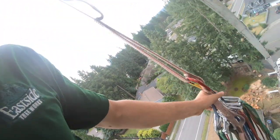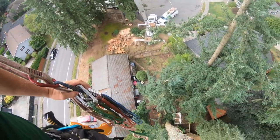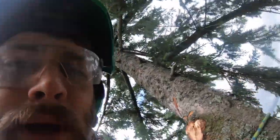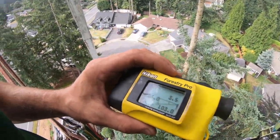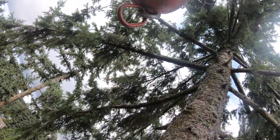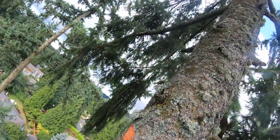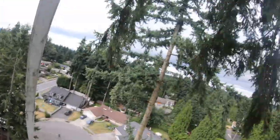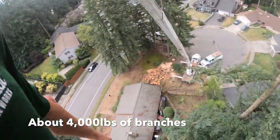I just wanted to show how to use the sling that nice guy Dave and myself came up with - that's the long jake. We've been working on this probably 45 minutes or so. I'm at 103 feet right here - we measured it at the beginning at 130, so I've got to take 30 feet off this tree before I get underneath the ball. If I had a bigger crane I could sling it here and take a gigantic piece, but if I topped it right here on the crane that would be incredibly violent. We did 100 feet of brush, probably thousands of pounds, in about 45 minutes.